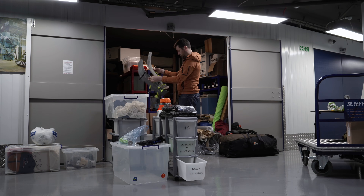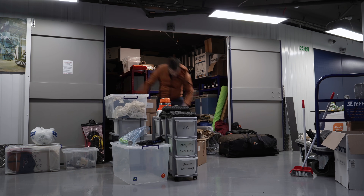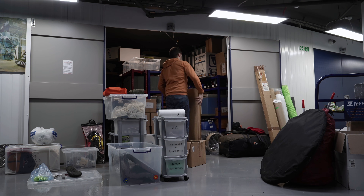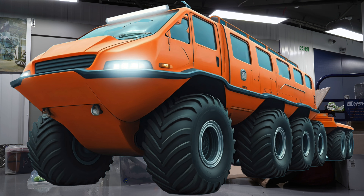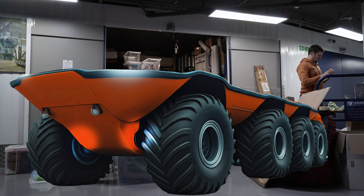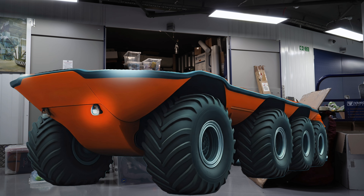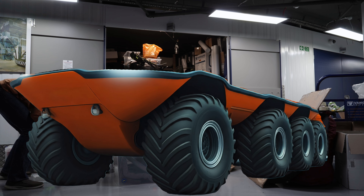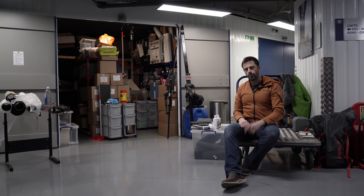Thickness, as well as the behaviour of fibres in the resin matrix, decides what a part will do under stress. I mulled over the lessons here for Bernard's main structure during an overdue tidying session at the warehouse. We will need each part of the shell — and it will be a shell — to have fibres running in at least four orientations. But I'm also interested in having some zones with more or fewer fibres, and perhaps even different types: perhaps where the wheel mounts are, where we need to bolt through solid laminate without foam core, or perhaps a more flexible zone where impacts are likely.